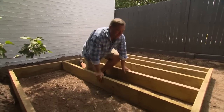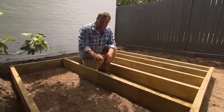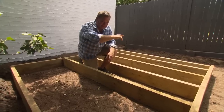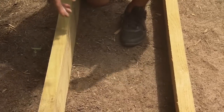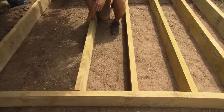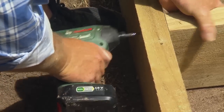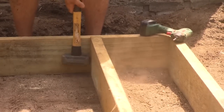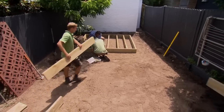This is one of the three frames. Now if you can build a sandpit — which is just the four sides on the outside — you can build the frame for this deck. It's exactly that: four sides and then inlaid with joists at 450mm centres. All of this is sitting on the ground so it's important that this is treated pine H4 — that means it can have contact with the earth. We're going to clad it with beautiful spotted gum decking, so from the top it's going to look great, but the frame underneath is as simple as putting A into B.